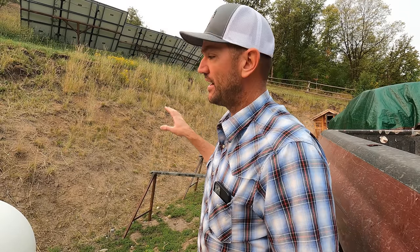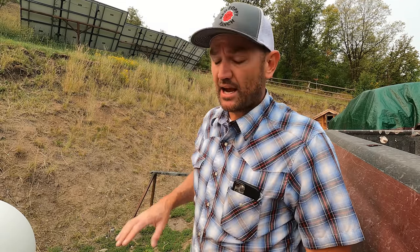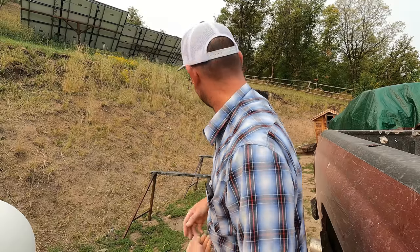All right, it's officially time to start putting tin up on the roof. I need to cut the tin from 14 feet down to 13 feet, and I'm gonna do that with my skill saw. I bought a blade that will cut that metal, but I need to change the blades out. And then I need to cut at least 15 pieces. It takes 15 pieces per side. I'm gonna do the front side first because there's no conflict with any vents or chimney or any of that stuff. And get that done. And then if all goes well, I'll maybe even get to the backside today.